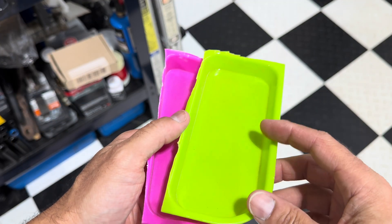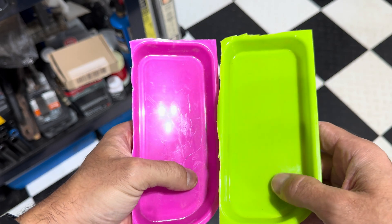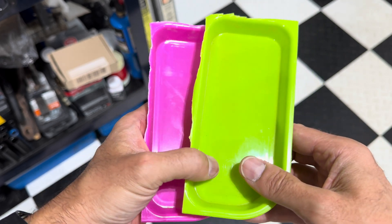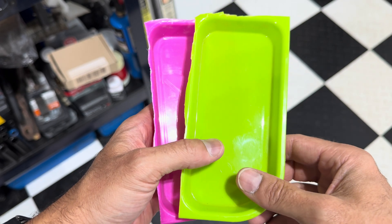This is what we're talking about with polyethylene and polypropylene plastics. It's this kind of plastic here where it's got that waxy kind of finish to it. It just doesn't feel like your typical plastics. What happens is because polyethylene and polypropylene have a low surface energy.